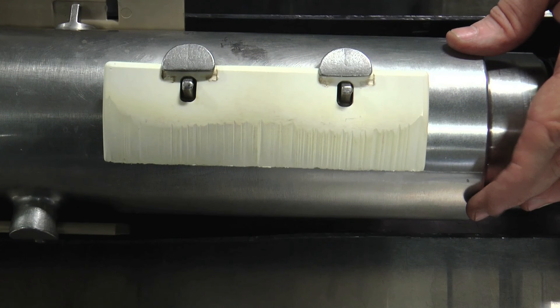As the blades wear across the interior of the heat exchanger tube, they wear into the contour of the tube. Each blade should be inspected for wear and signs of fatigue or cracking at the blade pin location and should be replaced if damage has occurred. Failure to replace damaged blades may result in future breakage, which can damage other blades or the heat transfer tube and result in blade particles in the product. Additionally, unscraped portions of the product tube surface will reduce the thermal efficiency and may be difficult to clean with normal CIP procedures.